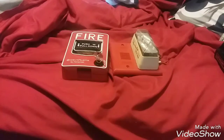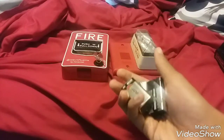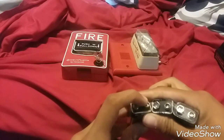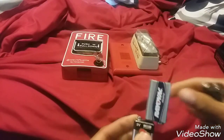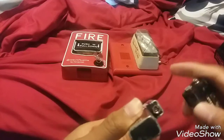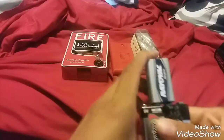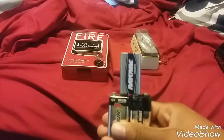I'm gonna show you how to wire the mini horn but not test it. You said how to hook it up to 9-volt batteries. These batteries are really old and basically dead, but you get three 9-volt batteries. This is positive, that's negative. You take the positive and stick it into the negative — boom, you got 18 volts. Then take that positive and stick it into the negative — boom, you got 27 volts.